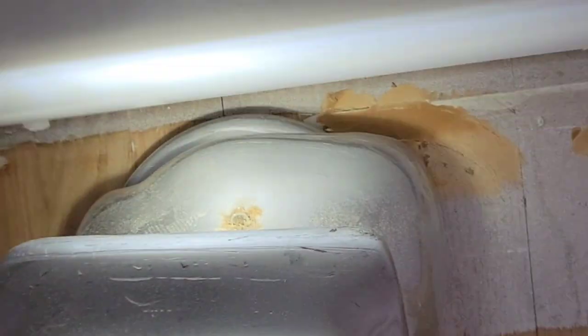You go past the line so when you go over with your final grit on the belt sander it'll get covered. Depending on how bad and greasy the floors are, you might need to change the paper maybe four times in a room, but that could vary. In this room I only had to change it twice.